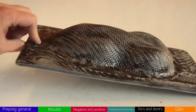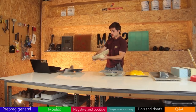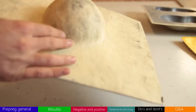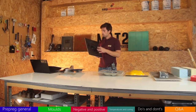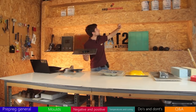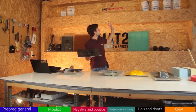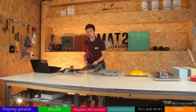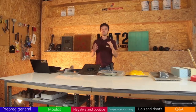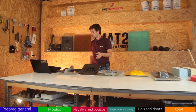However, if you use high-temperature-resistant epoxies you can make molds that will handle prepreg curing. Easy Composites previously had the UniMold system — sold alongside EasyPreg and Varipreg as the go-to high-temperature mold solution. It consists of tooling gel coat, a coupling coat backing layer, and vinyl ester with tooling resin on top, giving a strong thick mold with minimal shrinkage. You can post-cure the UniMold to around 110°C, which was fine for the old Varipreg that cured at 100°C, but with the new system curing at 120°C it gets more difficult.